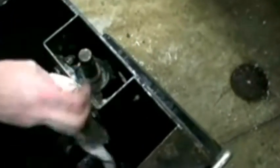Okay, what we're doing here is cleaning off. There is some salt that can accumulate on top of the bearing. The best thing to do is not try to blast it out with water, because you will actually drive the salt water right into the bearing. Better thing to do is to try to clean it off with an air gun, or wipe it off like we're doing here. The other thing that is very helpful for these bearings is to just coat the top with like a grease barrier, so when the salt hits it, it doesn't penetrate into the bearing, it just deflects down.